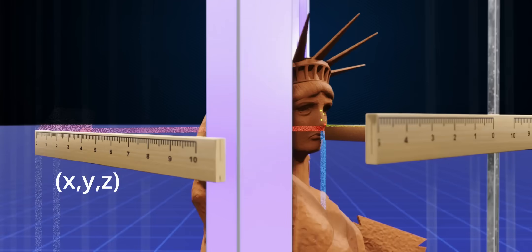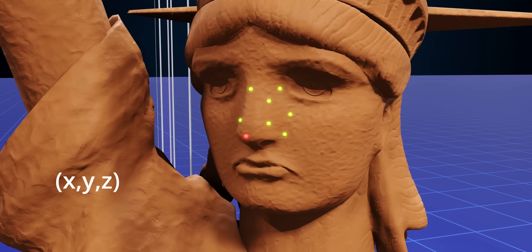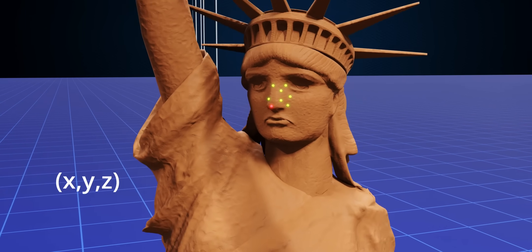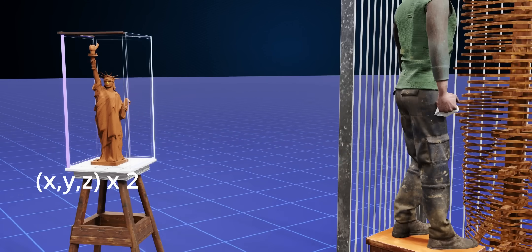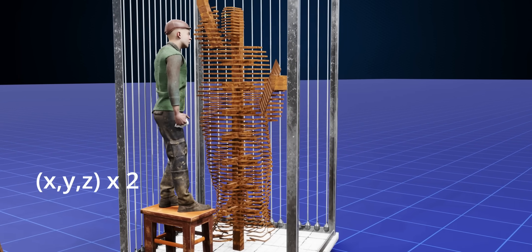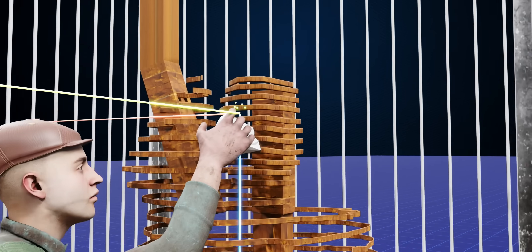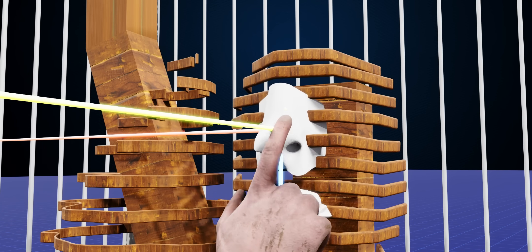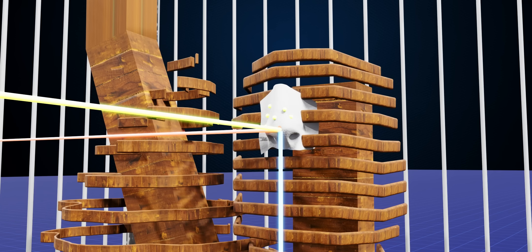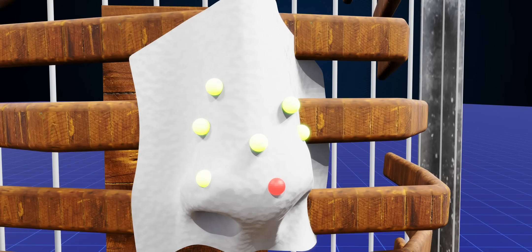The same technique was used to measure the Y coordinate value. To reconstruct a nose, many such points were marked and measured. To scale the nose up two times, simply multiply all values by two. At the other end, a wooden skeleton waited to be covered with plaster. Workers covered the nose with plaster conforming to the scaled-up measurements. When the plaster work conformed to the data values, the nose was scaled accurately.